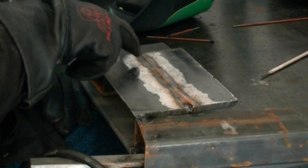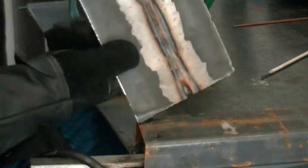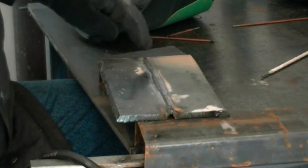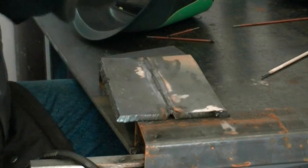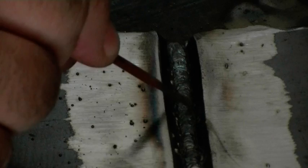We've used a step-and-pause motion to create the root pass, so I'm going to clean it up and show you in just a minute. This is the back side. It's been a while since I've welded an open root plate, but you can see the penetration all the way down. There's a little bit right here where the plate started closing up on me on the end. You can see the step-and-pause right here. It's been a while since I've done an open root plate and used a 6010 in this manner. But this is your standard test plate type weld for your root pass.